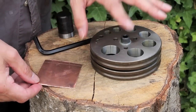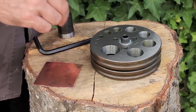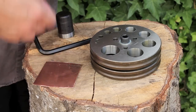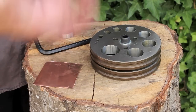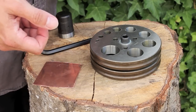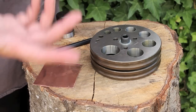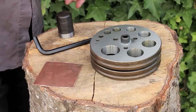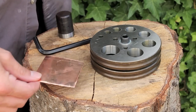I'm using a little piece of copper sheet here — this is 0.5 millimeter copper sheet. According to Durston you can use anything up to one millimeter in this unit, but they don't specify one millimeter of what. Obviously aluminium is a lot softer; copper, silver, gold are easy. But if you're using one millimeter sheet steel or stainless steel, that's going to be a lot tougher, so do use that as a guideline but think about it sensibly.